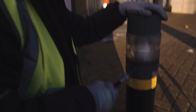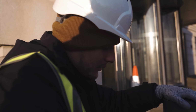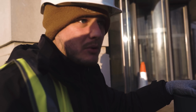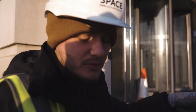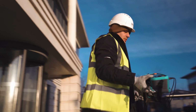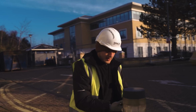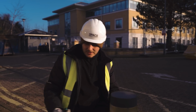If you add that value together with your Ze of the board that supplies this, that will give you your Zs. You can also test for your Zs, and that's the magic number that we want to make sure is below the prescribed value of the breaker to make sure the breaker trips on time. It's quite an important test. For the guys today though, to be honest, it's just so that they can design and also ensure that these circuits are okay, basically. How is that a different size? What are the chances in that?